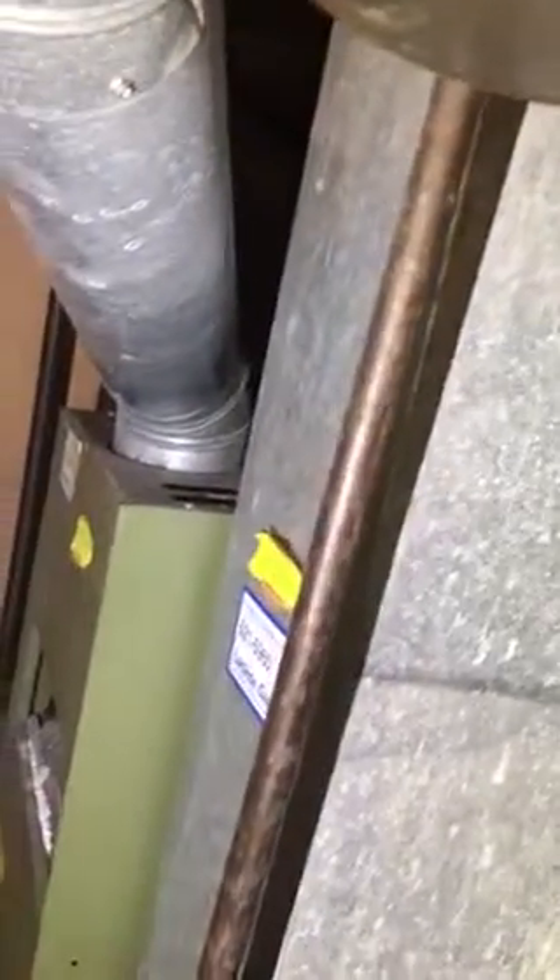She's probably going to go back with an 80% furnace, so the flue pipe is real simple. The gas line looks good back here, although she does not have a shutoff valve — it's on the outside — so we're going to have to put a shutoff on. I'll show you what all this looks like.